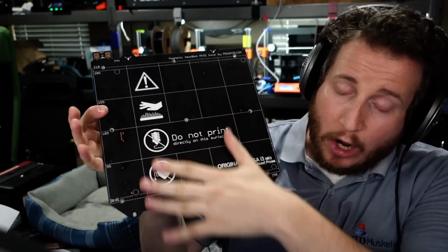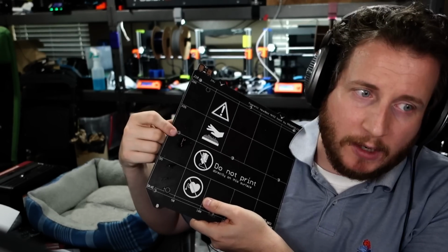This is from dragging off the build plate, but it's the same actual effect, right? You expose the copper tracing. Now, I've seen them way worse than this, where the actual build plate will short out the heater bed, basically causing it to fail. It can often kill the motherboard if it doesn't pop the fuse fast enough.